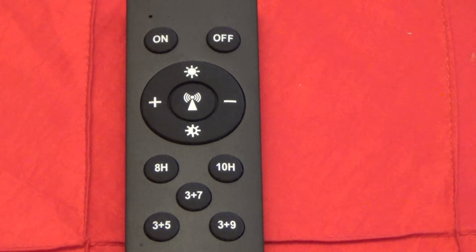The on and off buttons at the top are fairly straightforward — press on to turn it on, press off to turn it off. The key qualifier is that the radar control button is the primary driver. So if you've pressed the radar button and the light is set to kick on at dusk, pressing the off button only keeps it off until the next dusk, when it'll kick back on. If you don't want the light on for a few days, you'd have to press that off button every evening after the light comes on.